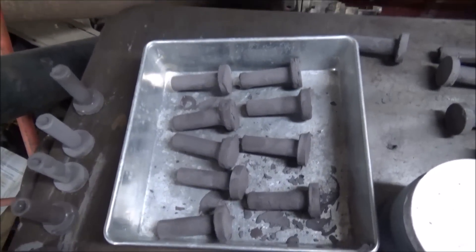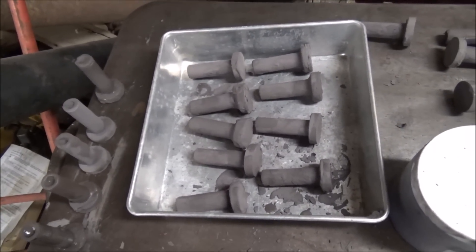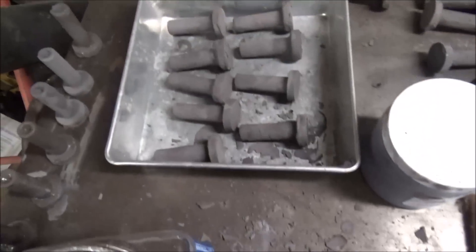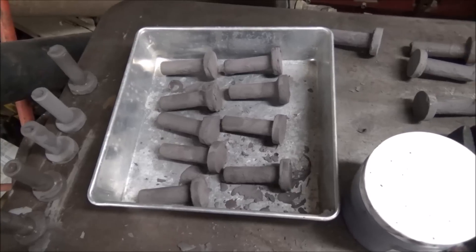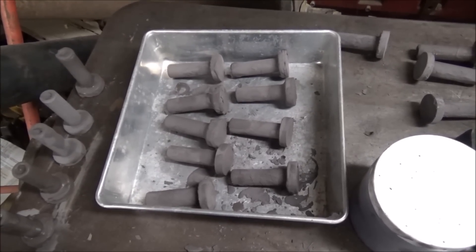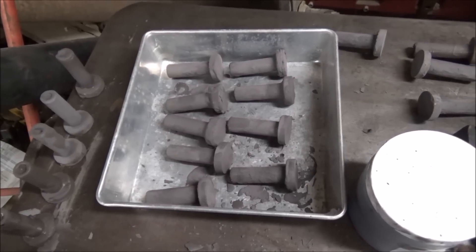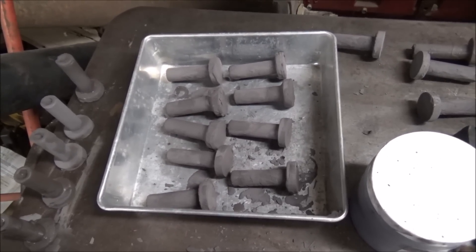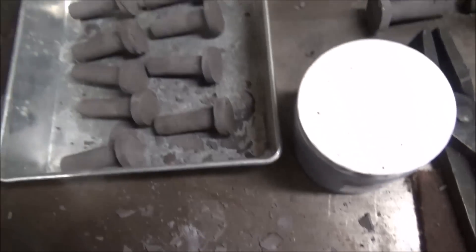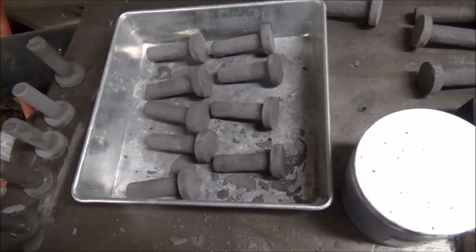So here I got them painted up. Initially tried to dip them — that didn't work. It went on way too thick and it was flaking back off, and it took a long time to dry too. So I've gone to paint it on with a brush, and that seems to work a lot better. The important thing it says is full coverage — obviously you gotta keep the oxidation from getting to it. The other thing I've learned is that the temperature can only go up on it. If you go up and then come back down, the coating breaks off. So this is a one-shot deal: heat it up once and then quench it and this coating's gonna be gone, because it is very brittle — you can see where I flaked it off here from where I tried to bake some on earlier, not realizing that that was the case. Maybe by the time that other piece is done, these here will be dried out and ready to go.